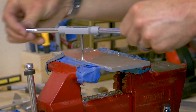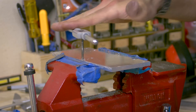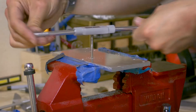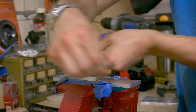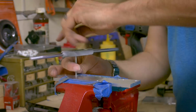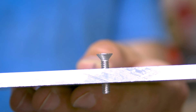This next step is a long and very slow process, and sometimes you just got to keep yourself entertained. Just remember: when tapping a hole, every half turn you make, go back a quarter turn — it'll save you from breaking tap drills and swearing in your shop. Here I'm just testing one of the screws to make sure the hole was straight and properly tapped.